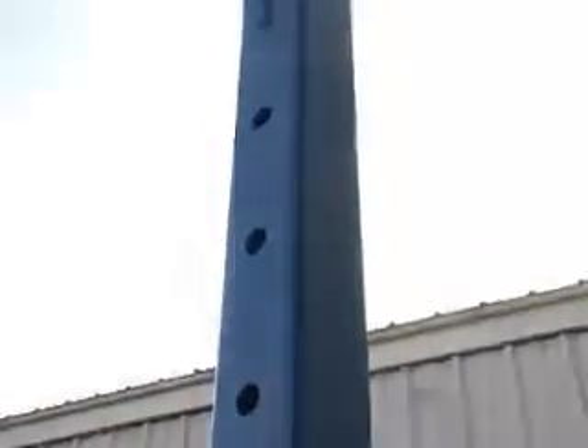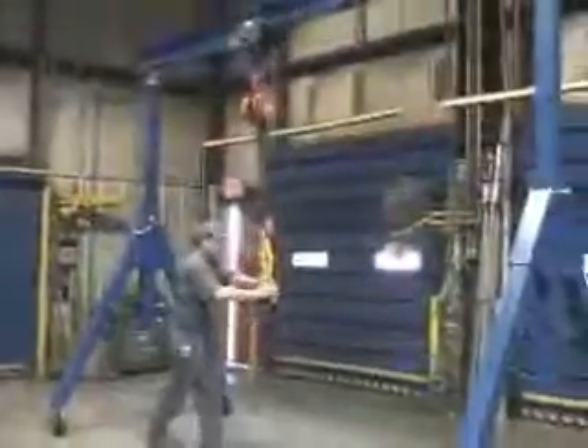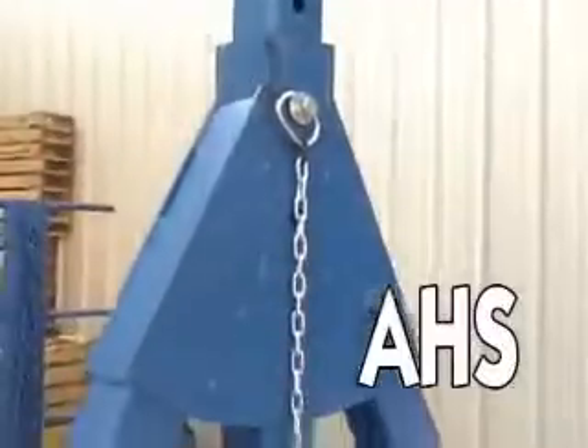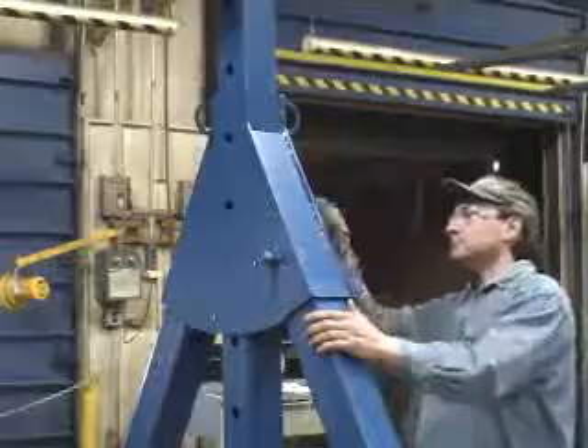To begin, Vestal offers over 50 different sizes of fixed and adjustable height steel gantry cranes with capacities from 500 to 10,000 pounds. Series AHS adjustable height cranes are ideal because of their portability and feature the added benefit of an adjustable under I-beam service range.